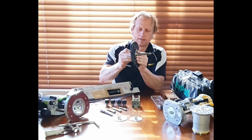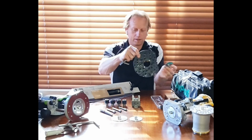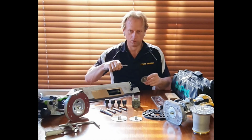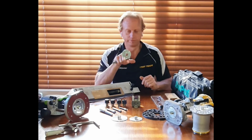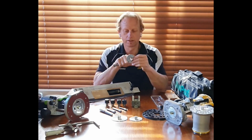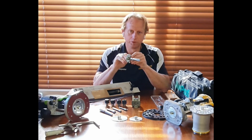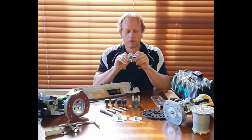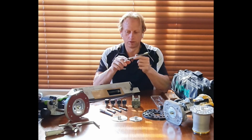So what I did is cut as far as I could with this. Then I removed the template from the door and just put the router straight on the edge of the door. That was fine because the copy ring goes around the cavity, so I wasn't going to go off the side of the door or anything. And that allowed me to plunge 105mm deep. So that was maximum. That was the maximum length, and it worked. But we will be ordering 160mm, so it'll be a bit easier.